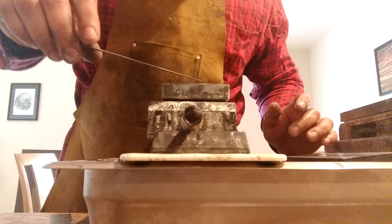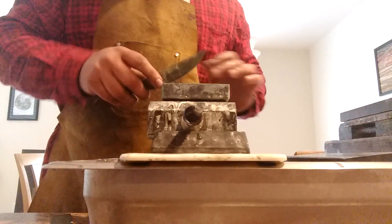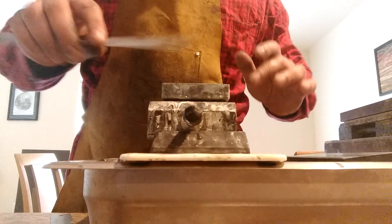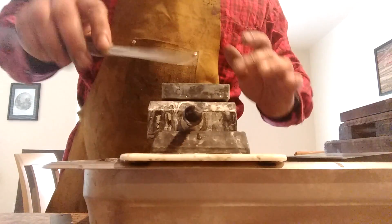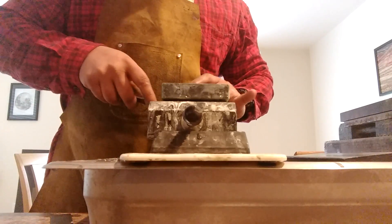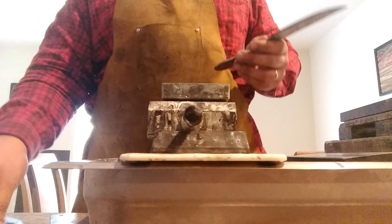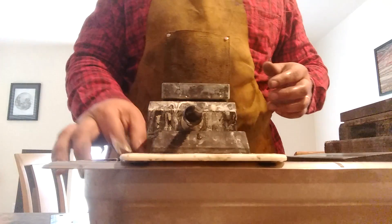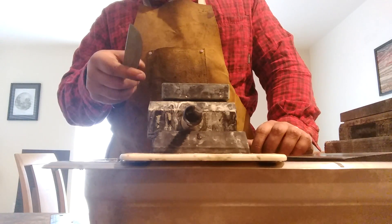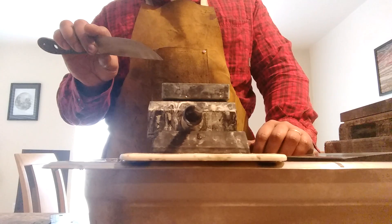I think I got the O1 steel harder. It feels like there was just a little bit more to grind, but I could be tricking myself because the O1 steel blade is actually a little bit thicker. My 52100 blades are 3/32nds and the O1 blade is about 1/8 inch thickness on the spine. We're probably about 25 thousandths behind the edge on all these knives right here. We gotta drop that geometry to about 15 thousandths — I'd really like to get to 10, because at 10 it just lasers through stuff. It seems like we get better deburring off the 52100 than the O1, but it's tough to say — we'll have to do some more testing.